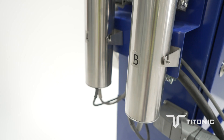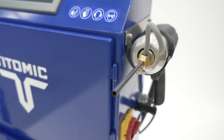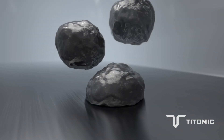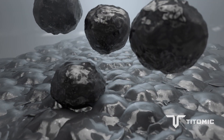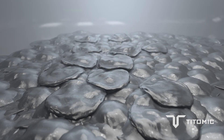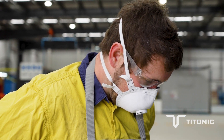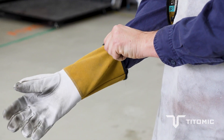What we do is take a really fine powder and introduce it into a supersonic gas stream. While introducing that powder into the gas stream it gets taken to a supersonic velocity, exits out the end of a converging-diverging rocket nozzle, hits the substrate or whatever part you're spraying onto, and then plastically deforms and adheres to the material. This allows you to repair parts not in the traditional way — you're actually using kinetic energy to bond those particles together.